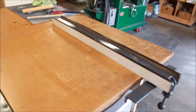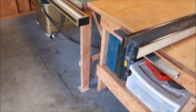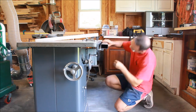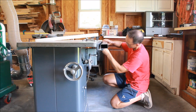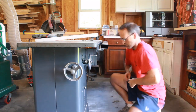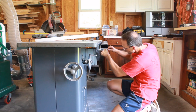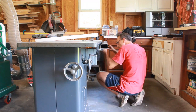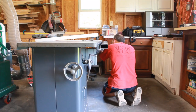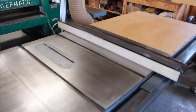Here she is — came out pretty good. I used contact cement to reattach these laminate faces after cleaning them up, and obviously repainted everything. Now I'm reattaching the front tube — the front rail that the fence slides on — using sheet metal screws into the threaded holes in the tubing, just tightening them up. It's a very simple fence design. When Bill Biesmeyer came up with this, it really revolutionized table saws in a way nobody foresaw. These are amazing fences — simple design — and virtually everybody's copied them now. My recovery is all done, saved from the fires as it were.